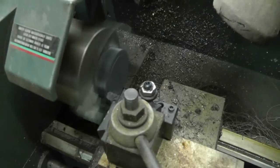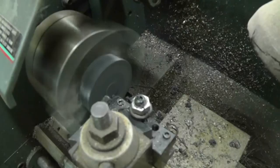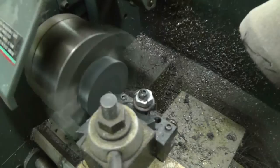So there hasn't been a video in a while, so I bring you machining hockey pucks. I'm surprised how well it works. I'm taking a 40 thou cut here. I found that if I take a deeper cut, it actually cuts a layer off of it, almost like a gasket.